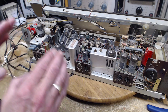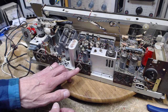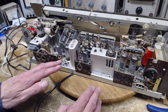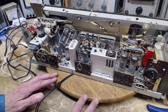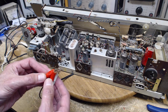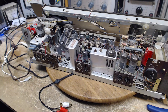Okay, so what I should be able to do is play the radio, play a station, like put it on broadcast, just have it playing out of the speakers. I should be able to find the signal in these pins. And that should tell me clearly which pins are the recording pins. And what I really want to know is which ones are the play pins. Those would be the other two. Hopefully I've soldered this correctly. But the reason I'm suspicious about this is because the level the stereo would produce from the Bluetooth receiver was lower than I expected. It was okay, but lower than I expected.